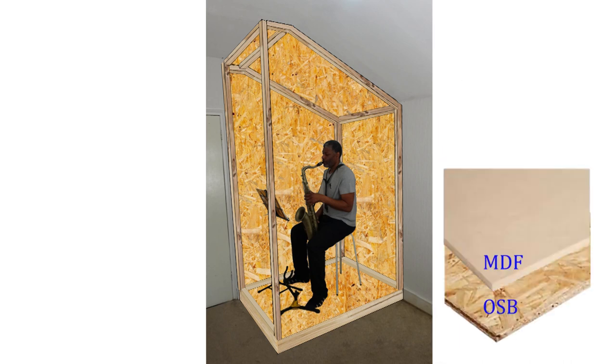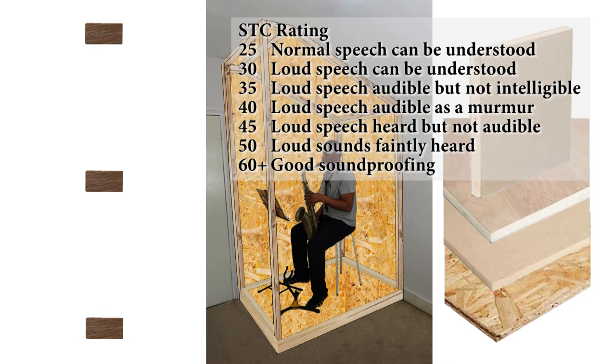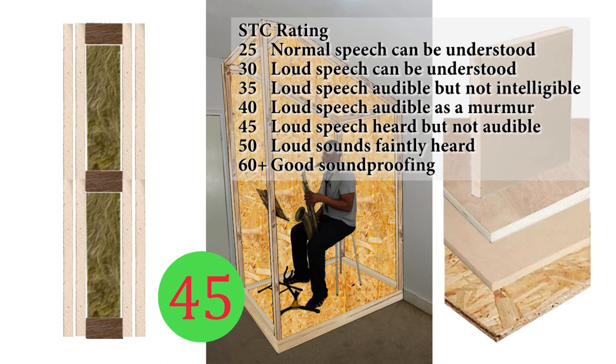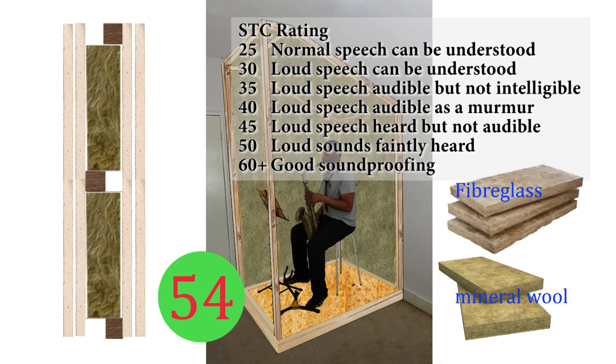For more soundproofing there is a choice of materials that could be used on the outside and inside of the framework: OSB boards, MDF, plywood, plasterboard, or drywall. Of all these, plasterboard or drywall will be the best at soundproofing due to its mass. A wooden stud with 16mm or 5/8th drywall on both sides will give an STC rating of about 35 with no insulation and 38 with insulation. If you have two plasterboards on both sides of the studs with insulation, this increases the STC rating to 45. Having an air gap between the drywalls — achieved using green glue or an alternative — will increase the STC rating further. Having staggered studs will also increase the STC rating. For insulation, fiberglass seems to be a cheaper alternative to products like rock wool and may be more cost effective overall.